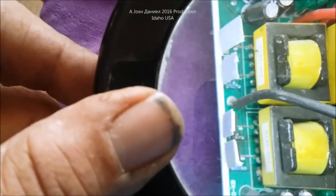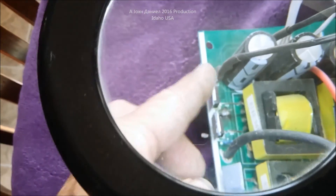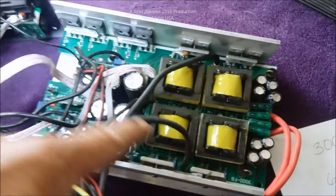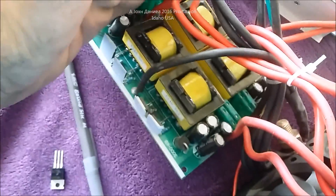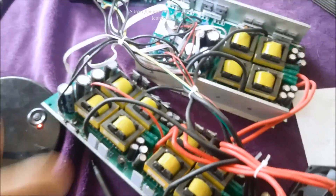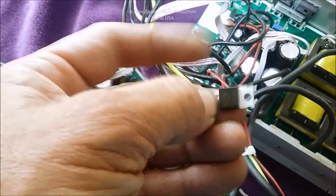It's strange at what point the bank burned out — this is both on the lower end of your square wave on this end and vice versa coming back. These two here serve the same purpose. Over on the other side, none of them burned out, which is really odd because that's usually the weaker side. Technically I have a thousand-watt inverter section here, another thousand-watt section from here back, and another thousand-watt section — with dedicated capacitors powering each board and maintaining required voltage.